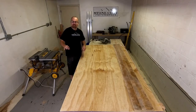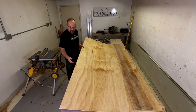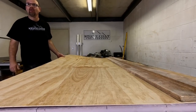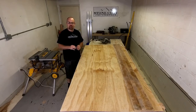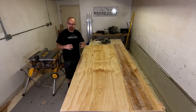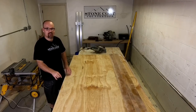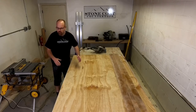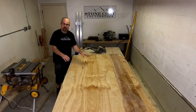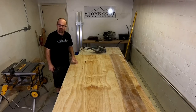It's time to learn how to template. We're going to get a one-eighth-inch piece of material — a one-eighth sheet of plywood picked up at Home Depot for about ten bucks. It doesn't matter what it's made out of as long as your glue will bite to it. We're going to cut it in half and then rip it down into two-inch strips. Let's get started.